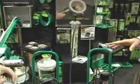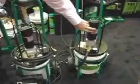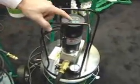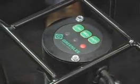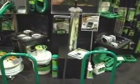Can we get a demonstration of that right now? Sure. The first thing you do is turn it on by pushing the on-off button, and then select the speed that you want to pump the lube by pushing one of these three buttons. I've selected high. And then it has a foot pedal to operate it. You simply put your foot on the pedal and it pumps the lube around the cable, and you can see in the demo the lube coming out.